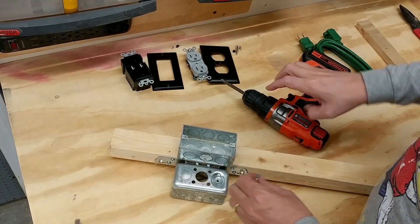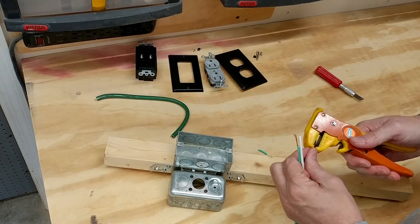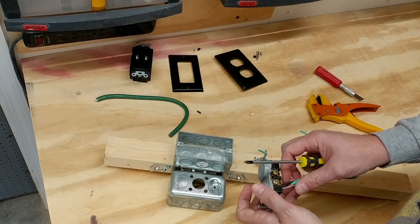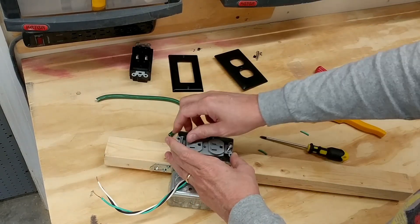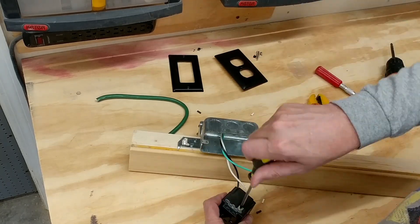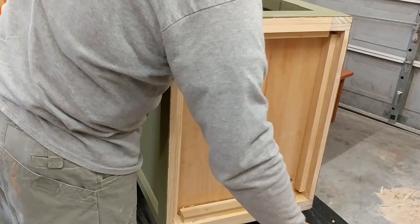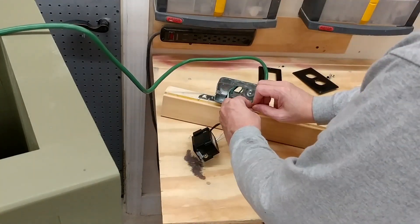Each outlet will be powered by the same power source. One will have two 110-volt outlets, and the external one will have two 110-volt outlets and two USB outlets, giving us a total of six outlets on the safe. The outlets are grounded to the power cord that will run down through the bottom of the safe. Even though we've tripled the number of outlets with four 110-volt outlets and two USB outlets, we aren't worried about overloading the circuit, because everything plugged into it is low power — even the lamp uses LED bulbs. So this isn't going to be a strain on the breaker. With the spine test-fitted into the back of the safe, it's time to drill the access port for the power cord. Remember that the power source for the safe is directly beneath it, so the cord just goes straight through the bottom and plugs into the floor. With the power cord threaded through the bottom, it's time to wire up the two outlets and get them ready to install inside the safe.